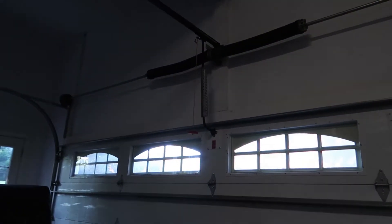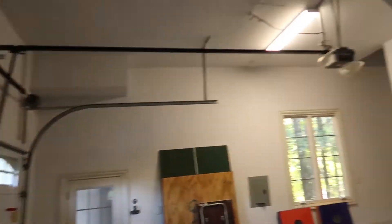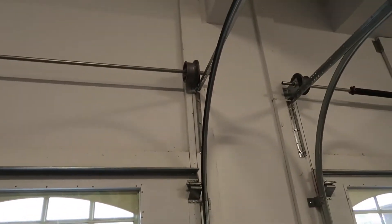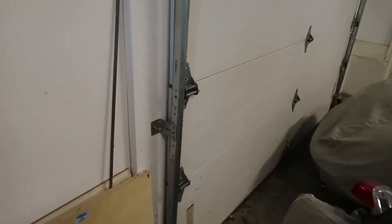You're looking for the safety release, which should be within six feet. I'm about six foot tall — it may actually be a little high; my wife would have trouble reaching it. And we're going to check the garage doors here in just a second. You want to check all the springs, the pulleys, and all the rollers and hinges.